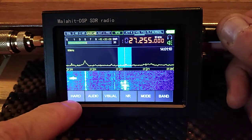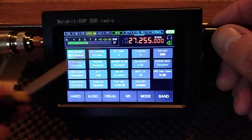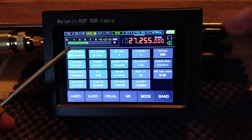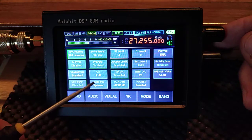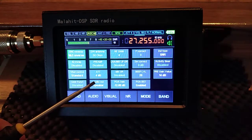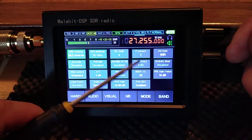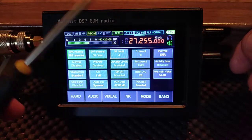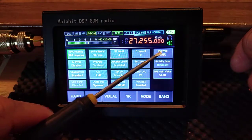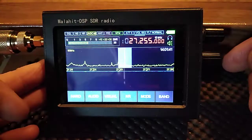You can do various things inside the settings. There are hardware settings — RF gain. You can swap the direction which way you want these encoders to turn. You can change your speaker output from speaker to earphones, or earphones and speakers at the same time. You can alter the gain, alter your signal meter calibration if it's reading a bit too high or too low, and even frequency correction. For your meter you can have your signal-to-noise ratio displayed.